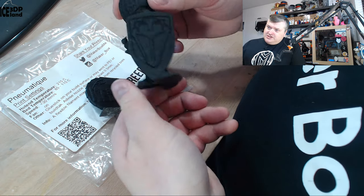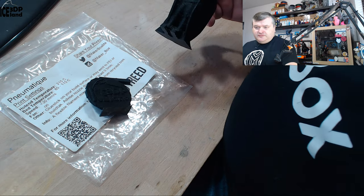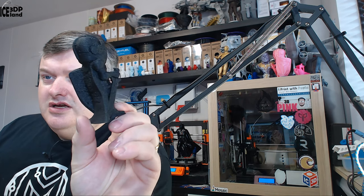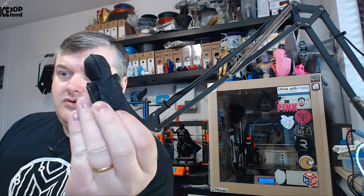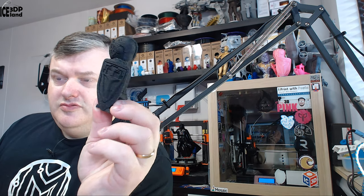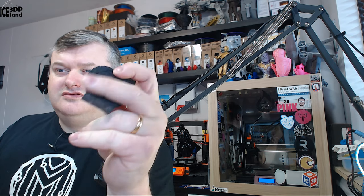Then I did a stringing test — that came out pretty nice. There was some amount of stringing though. It's again difficult to see, maybe on this camera — yeah, it's better to see on this camera. You can see a little bit of stringing in there. But it's flexible and there were really no issues printing, just printing at slower speeds at around 30 millimeters per second. It came out pretty nice. You can see the MakerCoin — this is printed without any infill, so it's just like rubber.